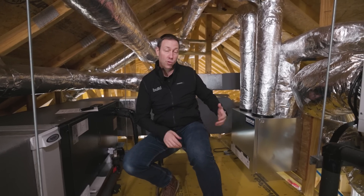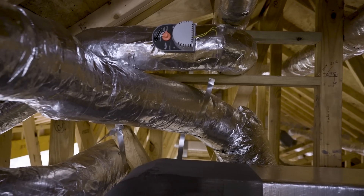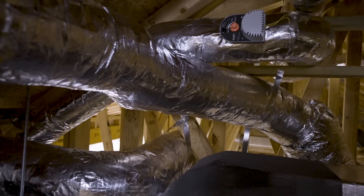If you've got an ERV or just a fresh air input, your house is going to potentially have higher humidity. If it's 80 degrees outside with 70% humidity, when you go outside it feels muggy and that's not fun. On the other hand, if you're using just your air conditioner to control humidity, sometimes it can feel clammy — that feeling of it's cold but still humid.